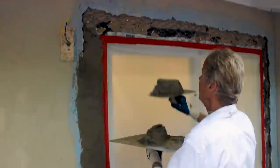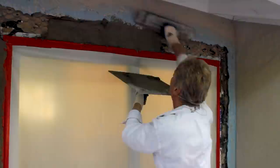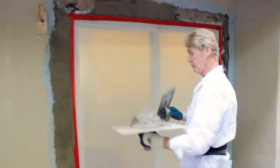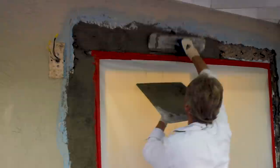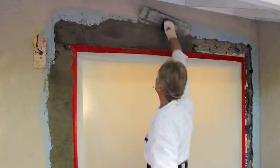The material I'm putting on right now is a bit sandy, but can we make it work? Absolutely. If you buy Rapid Set in 10 or 15-pound boxes, mix it in these buckets and just apply it — do not add sand. We buy the material that you add sand to, and it's usually three parts sand to every one part stucco. He watched our video on how to lath and he did a great job.